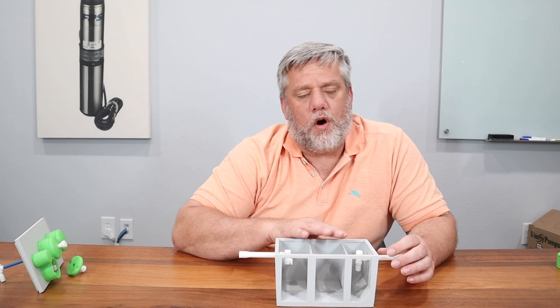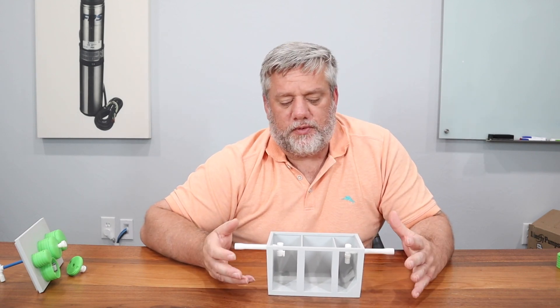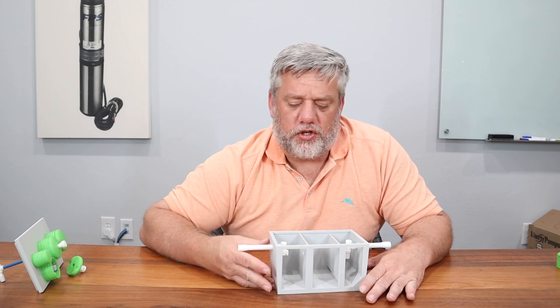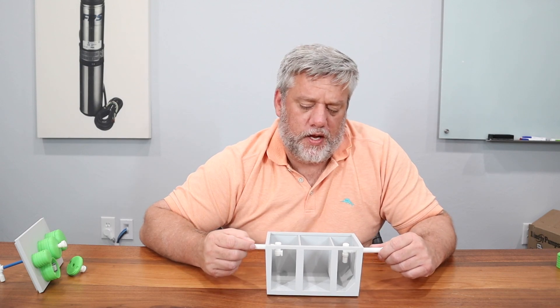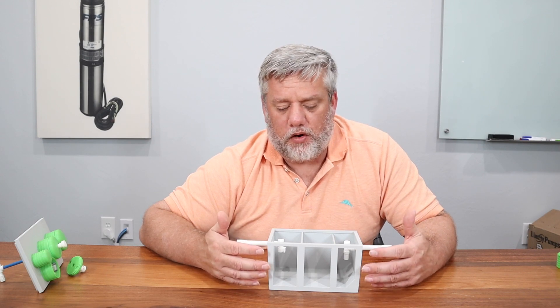On this particular system there's no pump tank, and some systems come like that. That would be a setup where you're gravity-feeding into leach fields — like up north or where the soil allows — and you don't need a pump tank. In Texas, generally this system would have an additional chamber on this side for the pump tank, with a pump in it to pump the effluent out.